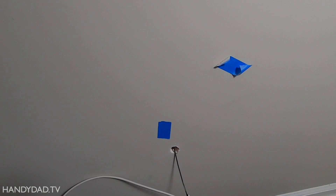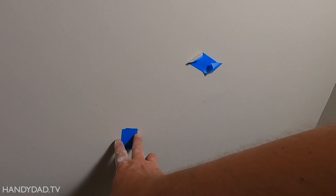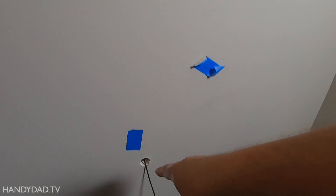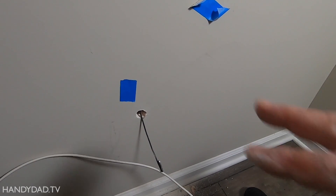My trick to doing that so easily — it's not really a trick. I used the stud finder and figured out the stud was right here, so I put my hole right next to the stud. And when I feed the fish tape, I feed it along the stud, and it always comes out — well, usually comes out — by the hole, unless I miss it and it goes beyond.